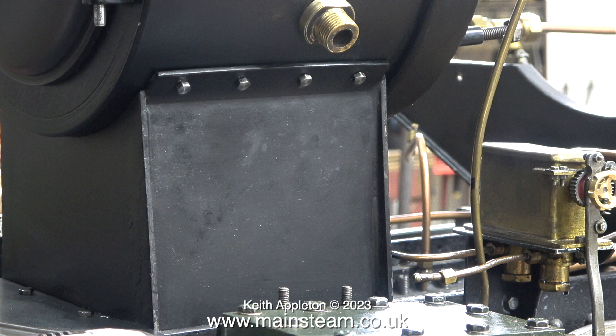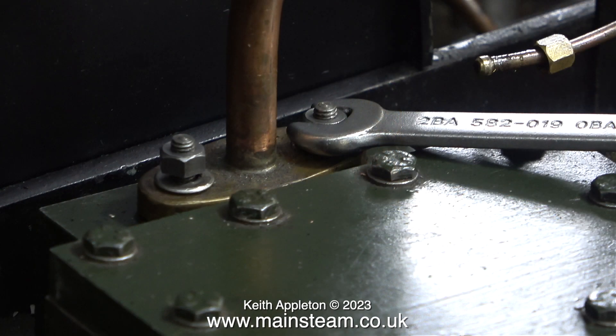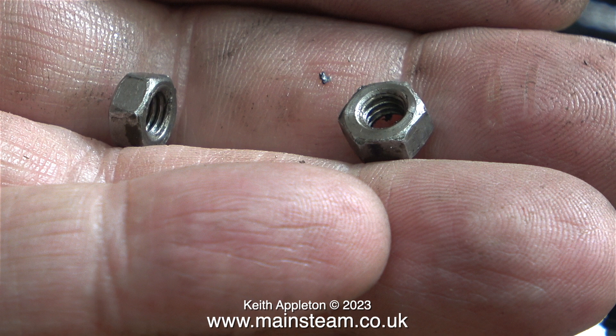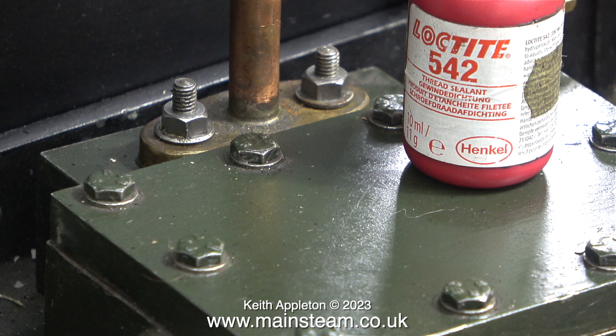I'd better mention that one of the last jobs in this area will be to paint all of the heads of the bolts in the smoke box saddle - I'm not going to do that yet, I'll do it at the same time as the other last jobs on the engine. Both of the studs at this side are considerably longer than the ones at the other side - this is not a problem. This pipe wasn't quite as good a fit, so I've very carefully tightened the nuts one at a time to pull the flange down onto the steam chest. Now both nuts are tight and everything's okay.